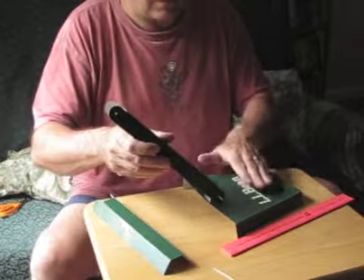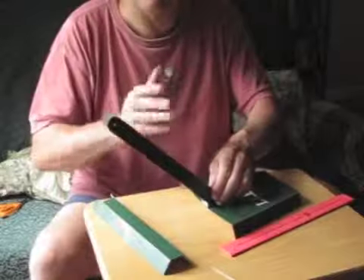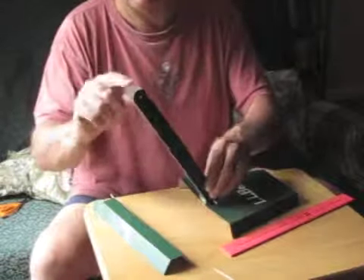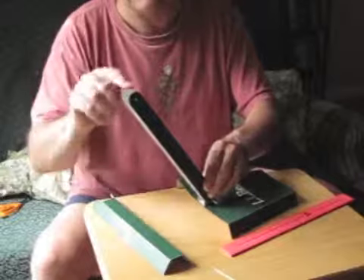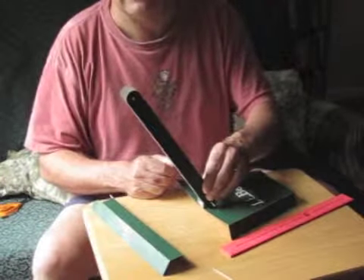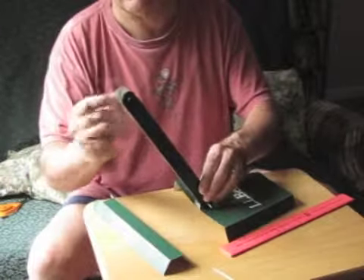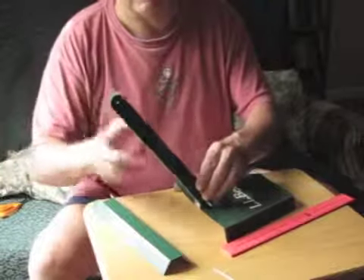There's still plenty of area here to put a counterweight. I just felt that it needed to be a little more compact. Now the curves here — this arc is basically based on a quarter. So once these are made, we can use a quarter to draw an arc and then just use a grinding tool and cut these.